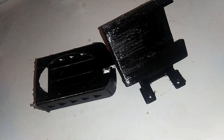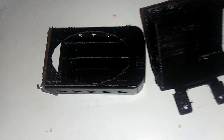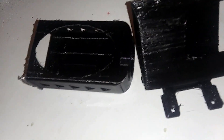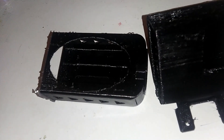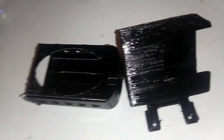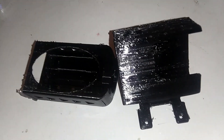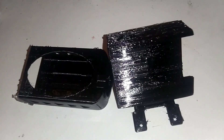Now all I have to do is mess around with the settings. The extruder doesn't let TPU out at the top — there's just not enough room. The Bowden tube is so much smaller on the inside; it's a perfect size. So it's pushing it through — even if it started to clog, it would still push the TPU all the way through the clog. And I think it's just a way more efficient extruder. I haven't seen any type of clogging or anything yet, anything remotely close to clogging. I don't think it's possible with this extruder — just because of the way that it's designed.